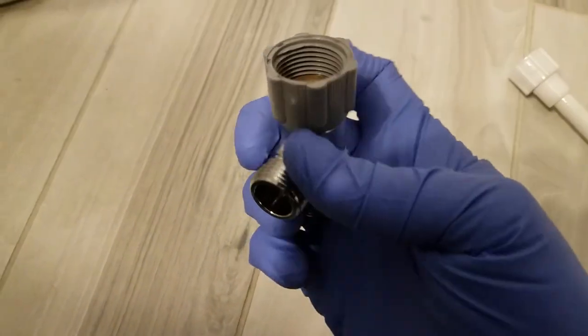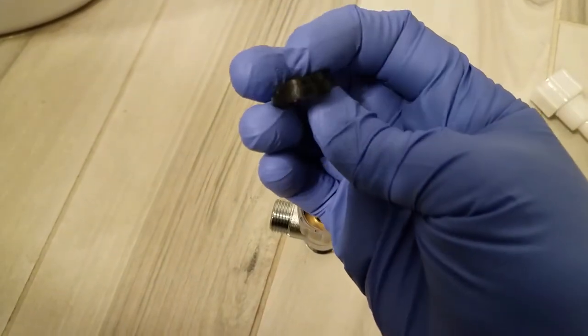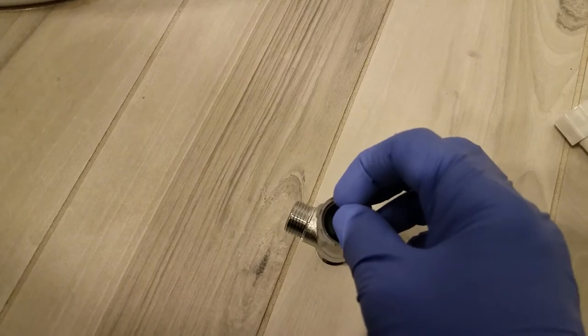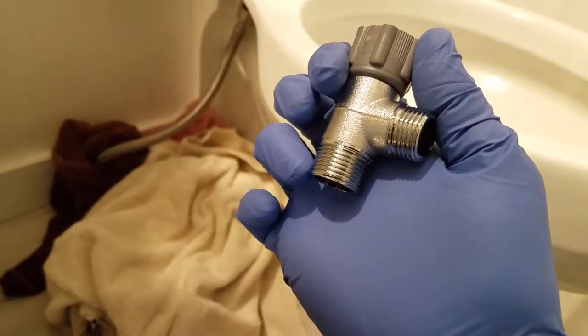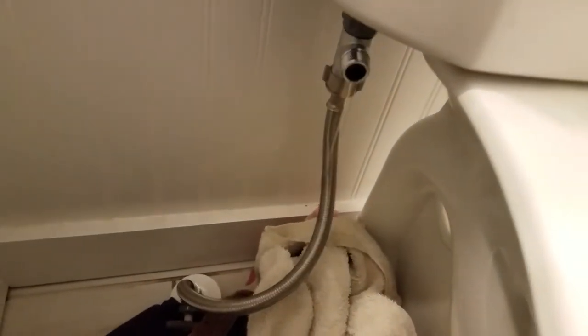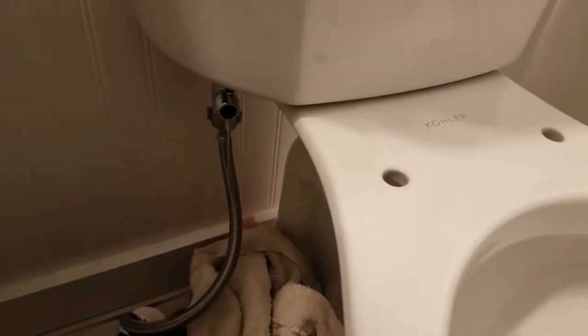Here's the T-valve. This end is going to go towards your toilet tank, but it needs this little gasket. You see how it's sort of a cone? One side is narrower than the other — that narrow side needs to go face up towards your tank. No Teflon is needed; you just hand tighten this. Make sure that the side port is pointed forward. Then the bottom will connect with the line that you already have there. If your valve is anything like my valve, you'll have a bit of a leak running. So you'll probably want to install the hose so you can force the water into here while you do the rest of the installation. Again, no Teflon tape needed — it simply fits over the end and you just hand tighten.